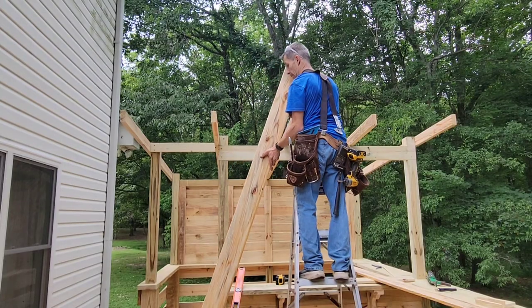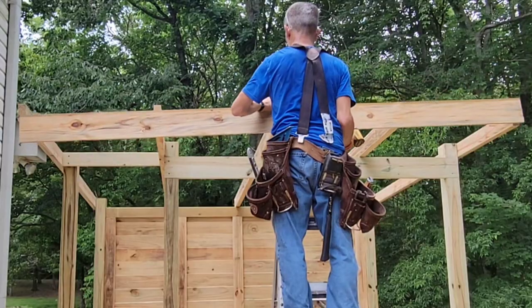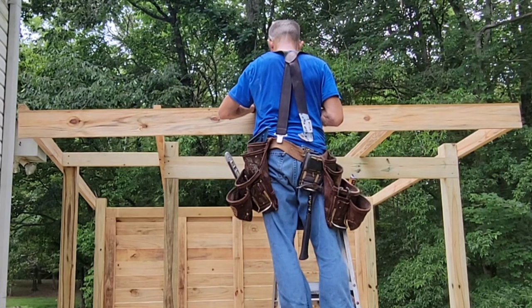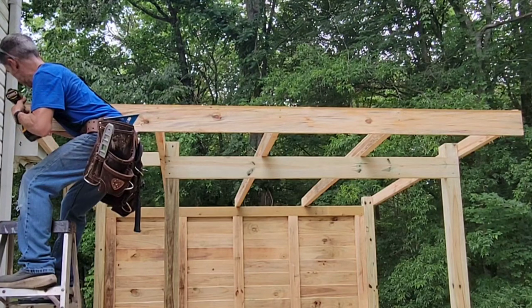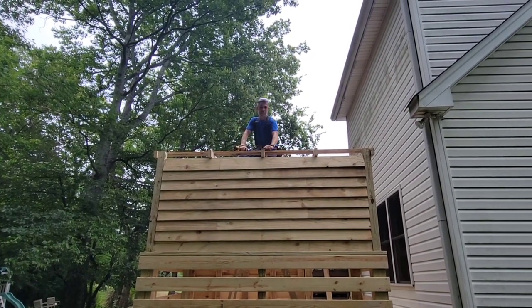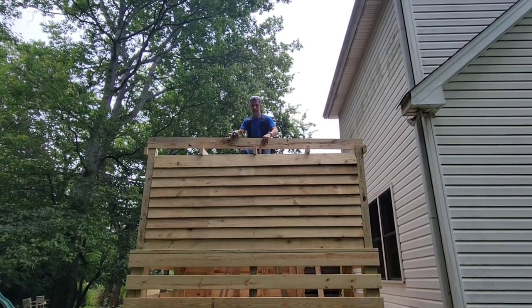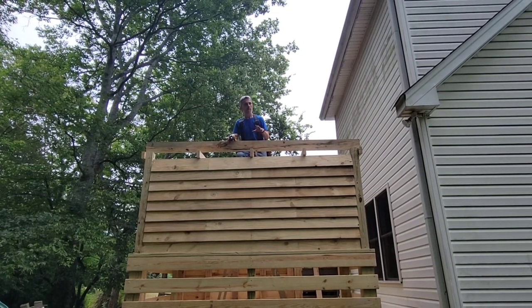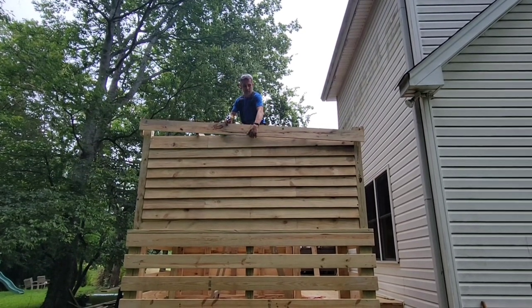This one at 55 and a half. So when I put our crown up, guys, remember, our crown up. All right, guys, so what I did was I measured from the end of that rafter to the dead center here, made a mark at 55, and then I measured from the end of my one by, made a mark at 55. That way, if you're ever in a situation where you're here by yourself, you can just line these two marks up and you'll know that you're flush on both ends. All right, going down, getting it started.